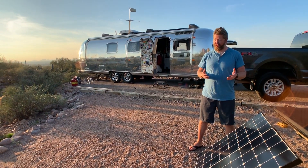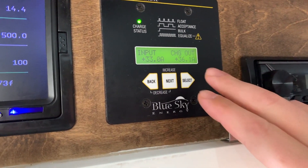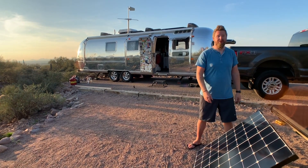We also added a new beefier inverter. Quick follow-up: we got really excited about five amps coming in, but that was at the end of the day with the sun going down. Now that we're actually using all 700 watts, we've had it for a few days and we're excited to report that we get about 40 to 45 amps coming in during peak hours — which is perfect for us. You can see the charge controller here — it's noon, putting out about 36 amps and it's a little cloudy, so it'll go up in a bit. Before, we were losing about five to ten percent a day even on a sunny day. Now, even on a cloudy day we're able to catch back up quickly and fill up our batteries every single day. So far so good — it all worked. Now we've got a huge mess of tools and wires to clean up.